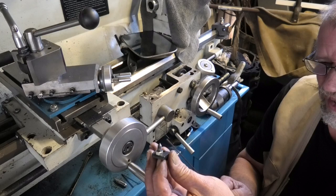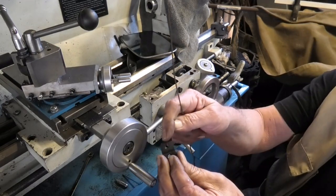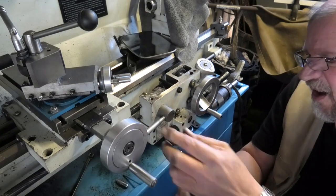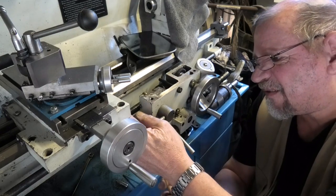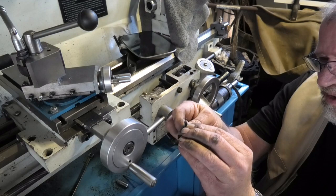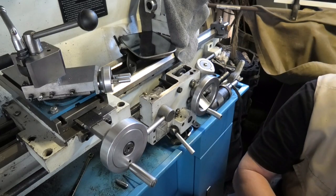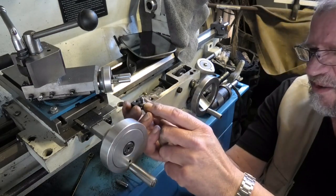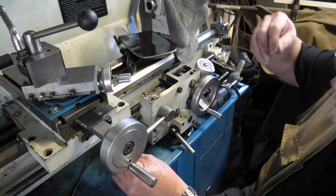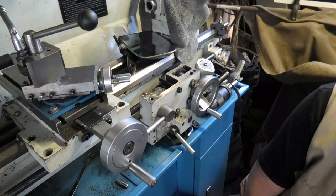Looking more carefully, this is not actually an adjustment mechanism — that nut is just to lock the set screw into the plate. The set screw can't go lower than the bottom of the plate because the plate sits over the top of the apron. It's just an anchor pin to retain the plate where it is. So the adjustment I need will come from stacking washers underneath the carriage clamp bolts.